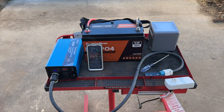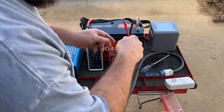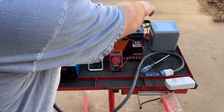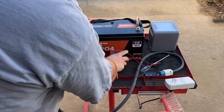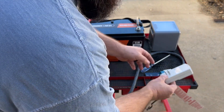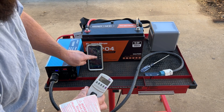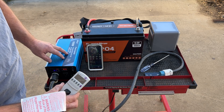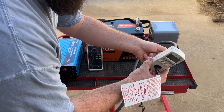I really like this app. Now I want to check the battery voltage with a cheap Cen-Tech meter from Harbor Freight. We're reading 12.89 volts right now on the top of the battery. I'm going to go ahead and plug up the Handy Heater and turn it on. I'll also show you the kilowatt meter. Once we plug up the kilowatt meter, that's when the test starts. On the app you'll see the amperage discharge jump up to about 100 amps, and the power inverter and kilowatt meter will show output as well. We're about to start the test right now.